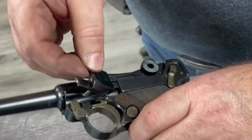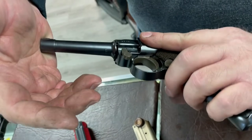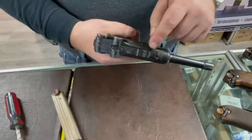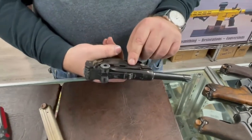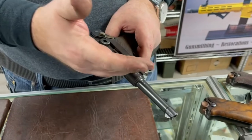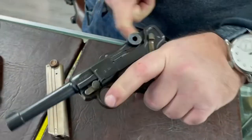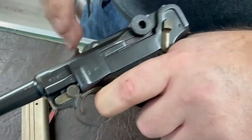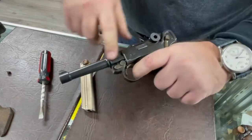Take the upper upside down, set it on the rails about 3/4 of an inch, then flip and hook the two components together to ensure correct spring tension. Place the side plate — it has a notch on the back that corresponds with the frame. Push back and lock the lever. When you pull the trigger you should hear a click — that's your engagement.